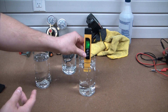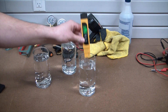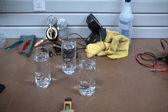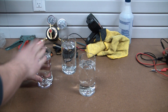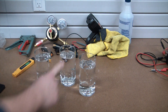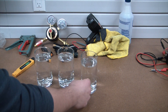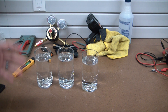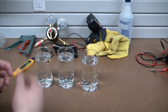I don't yet have an RO system here in my house, but that's actually what I'm going to be putting in. From the RO system I'm then going to be doing deionization, which will bring it to a state of purity above that of typical distilled water. Our goal: take this water coming in at 420 TDS and bring it down to essentially zero. I'm going to branch off the RO system — send some up to the kitchen for making coffee and tea, which will be just straight reverse osmosis at maybe 10 to 30 parts per million, and then put a branch off for use down here in the lab.